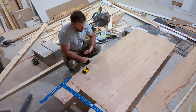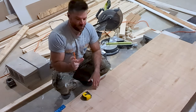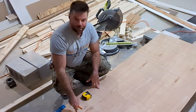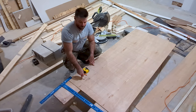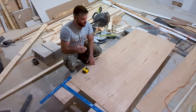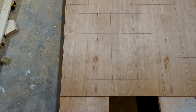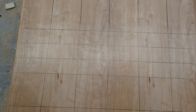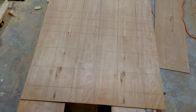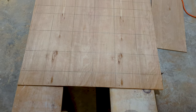Going horizontally, I'm putting the lines in the middle of each cutout. Each cutout is two and a half inches wide and I have a two-and-a-half-inch hole saw, so if I park it in the middle and mark an inch and a quarter down and an inch and a quarter up from every start and end point of the cutouts, that's exactly where the hole saw line will go. Cut it nice and straight, jigsaw in the middle — I think we're getting there. Where there are cross lines, it's either the start or the end of one of the cutouts. Where it gets really close together, it's because the lights are staggered and the end point of one isn't necessarily the beginning of the one in the next column.